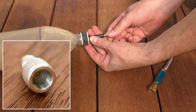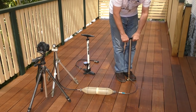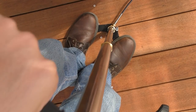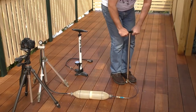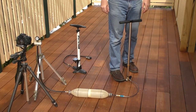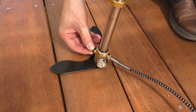Now it's time to try the PCP pump. We used one of the adapters that came with the pump, though we had to put in a nylon washer to make it seal against the Schrader valve properly. When using these pumps you want to go all the way to the ends of the stroke for maximum performance. To get to 120 psi it took about 85 strokes, though the effort was pretty much the same as it was at the beginning. It took a total of about 170 strokes to get to 210 psi and it was still fairly easy, nowhere near the effort needed for 120 psi with the regular pump. It took about five and a half minutes to pump in the 30 litres of air, translating to about 180 millilitres per stroke. We stopped the test at this point and let the air out. The pump has a bleed valve at the bottom.